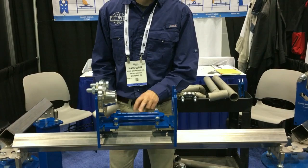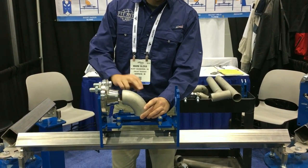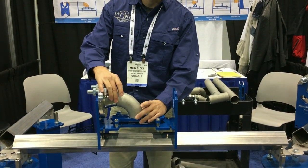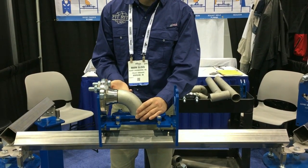The fitting cradle bed is designed to be adjustable, but it's been designed around a long radius elbow. In this case, the center line already matches with the flange. If I want to make this fit, I just feel for flush at the bottom, flush at the top. I can set my weld gap and adjust up or down if I need to.